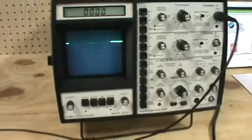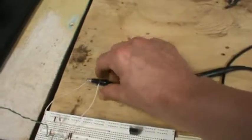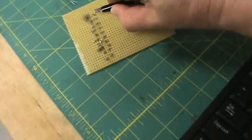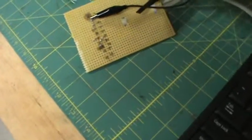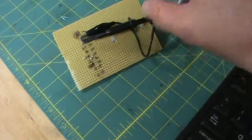So the commands are passing through, but they are being broken up somewhat. So if I take the oscilloscope leads off of the downstream end and move up to what's going in on the upstream end, we're not able to see any of the replies. Or if we do, they are 1 in 1,000. They're very, very sporadic.